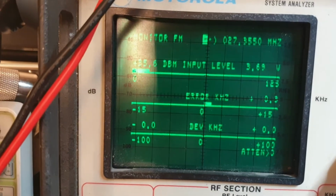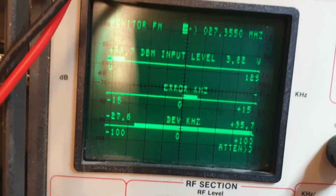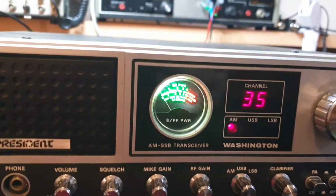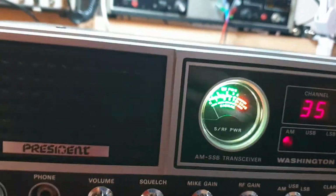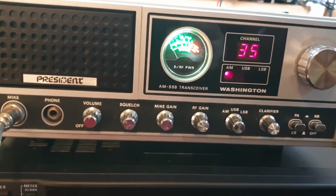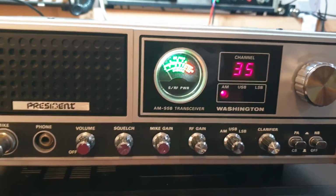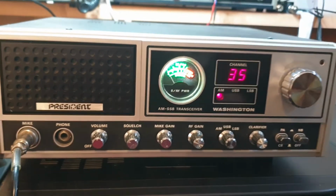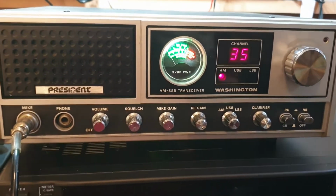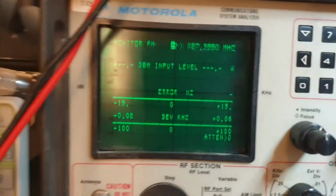Yeah, that's okay. 3 points. Hello, hello. Test 1, 2. 3.7 watts on carrier. And they're funny, they've taken the sideband quite high on this, and AM they've left pretty much standard. Not a bad idea, just to not over stress these things on AM, but yeah, look, that's not too bad. Just forgot to check upper sideband, just have a little look at that as well.